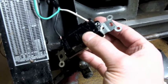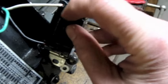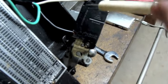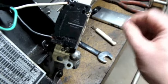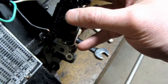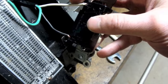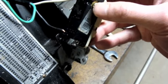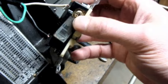In this particular style of switch, those little slots right there, next to the hole, you put a very small blade screwdriver in there and pry, and that disengages the little clamping action in there. Insert the wire, and then you pull the screwdriver out, and it snaps closed on it. Works pretty well. This wire is a little bit of a light gauge, because this is number 14 stranded wire, and this switch is for number 14 solid wire, but this should work fine. It's not pulling out easily.